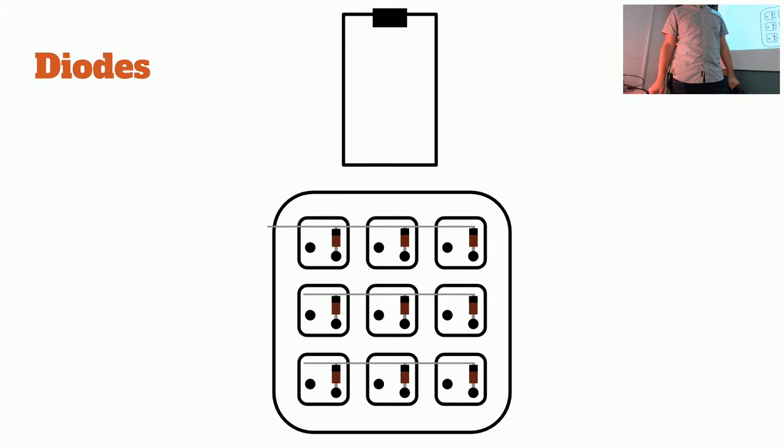So what I found, one way that works is when you start from here, when you bend this over, the wire is going to stick past this other diode. If you bend it up and then bend that around it, that gives you a joint like this that makes it a little bit easier to solder. And then when you're done, you'll trim up the extra piece of this first diode,